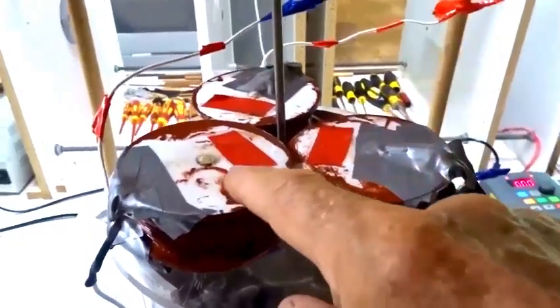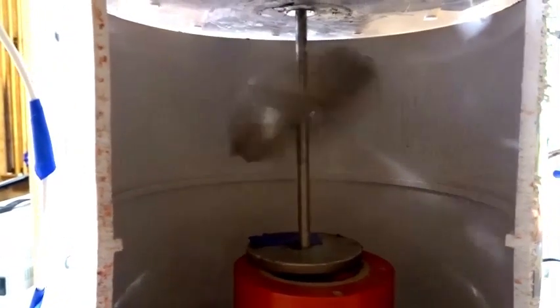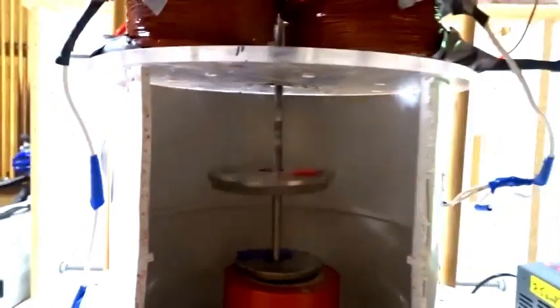Let's continue. Three wire coils UVW with the three-phase variable frequency device. Down here I've got a 70 millimeter magnet with about a 10 millimeter hole in the middle so it can wobble a bit. Below it, I've put a 50 millimeter magnet just to hold it in place by magnetic repulsion. As we add the three-phase power, it begins to wobble, and then at fairly low frequency it rises way up. I don't want to go any further — it might break the machine.